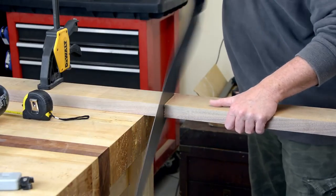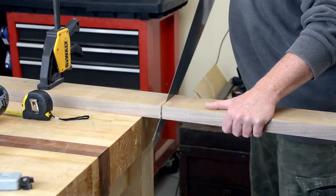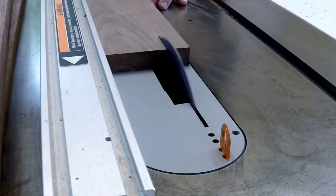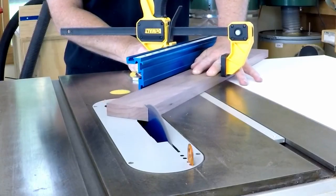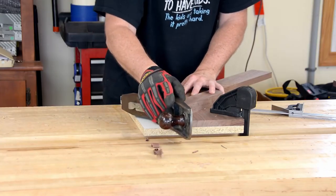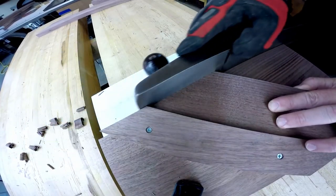Next up is the stock for the front door frames. I've switched to making a lot of my rough cuts in stock with a hand saw because it leaves the sawdust in a nice little pile on the floor instead of all over the shop. I've switched over to miters for the corners on the front doors of this project — they come off the table saw pretty good, but they come off a shooting board perfect: exactly 45 degrees and totally square to the face of the board.